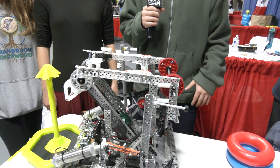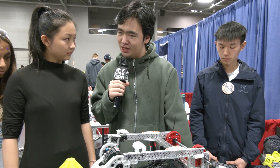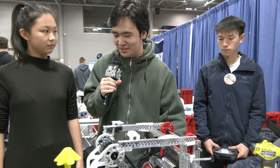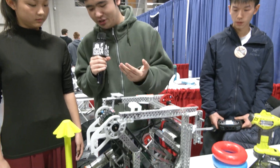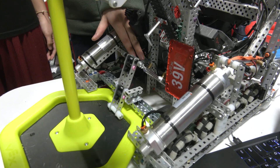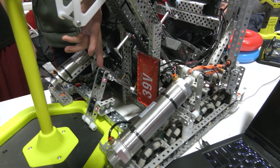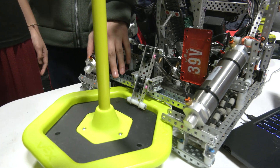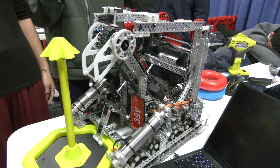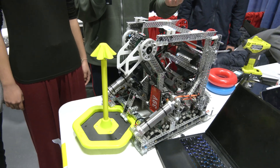One more interesting detail: the intake's lower conveyor has vertical plastic pieces — it's really low friction, much better than just flat curved plastic. Looking at changes throughout the competition season — yeah, the intake plastic was one I already mentioned, changing from flat curved plastic to vertical curved plastic for much lower friction. Other changes include the clamp's geometry: we changed the mounting point of the piston — it was pushing so hard it bent the C-channel, so we switched to steel and adjusted the piston geometry. Moving forward, we're thinking about making the robot shorter overall, having the arm shorter so we can flip all the way over to knock rings and score on the wall stake during autonomous, and possibly going for a higher hang in the future.